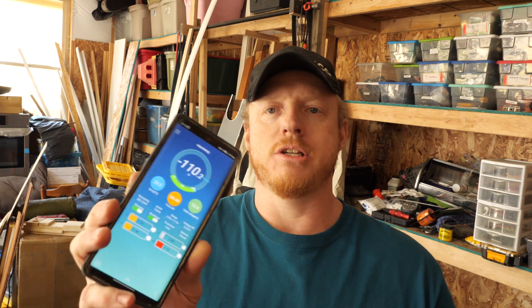The heater on high did surge to 130 amps and the BMS did not shut anything down — it took that power briefly, and once the heater kicked back down the BMS didn't need to intervene. All this testing is what I've been working through. I'm not sure how it'll all come together into a video. I still have a power supply on order; I'll run these through several charge and discharge cycles, then disconnect, put back into parallel with copper wire, and rebalance. I'm still pulling 1362 watts and the BMS says it'll be a couple of hours.